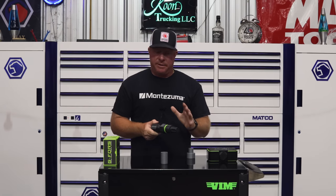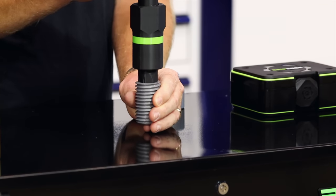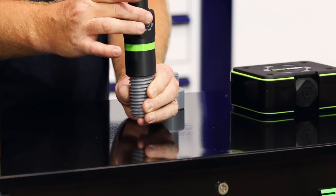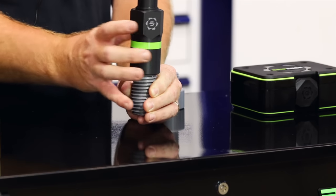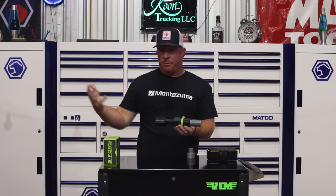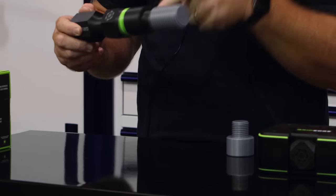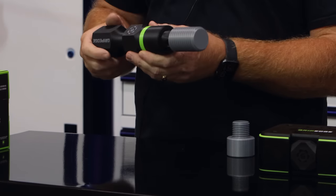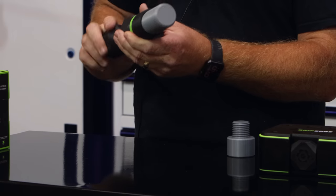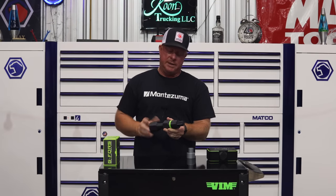Another advantage: if you drive it in and it has a little bit of wobble, you simply tighten the sleeve down until it touches the base with a little snug pressure and now it's completely firm because it covers more surface area on the top of the extractor. And once you extract your bolt, the problem with every other extractor is how to get the broken bolt off the extractor without damaging it — that's where the FOR sleeve comes in. You simply twist it and it pops that broken piece right off with no damage whatsoever to the teeth.